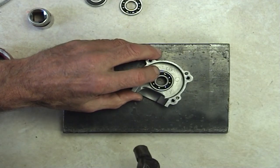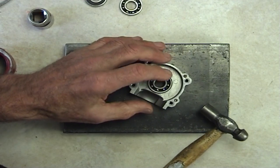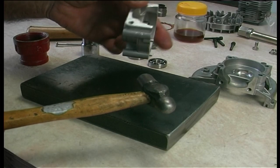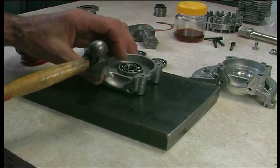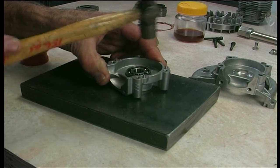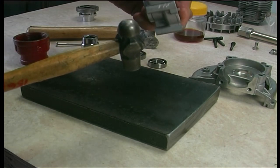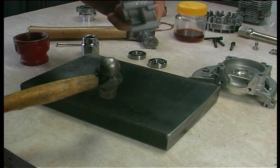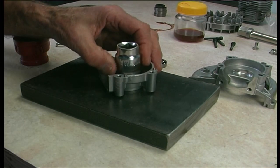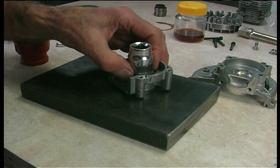It's a little bit high on that side, so give it a slight, very slight tap. You can actually feel the bearing moving down into the recess. Pick it up, have another eyeball — it looks fairly level. Tap from side to side; you can feel it giving. Probably a little bit on the high side up there, so a little bit over here. Get your prepared socket and give it a few taps. Attempt to hit slightly harder over this side — don't be scared of it.